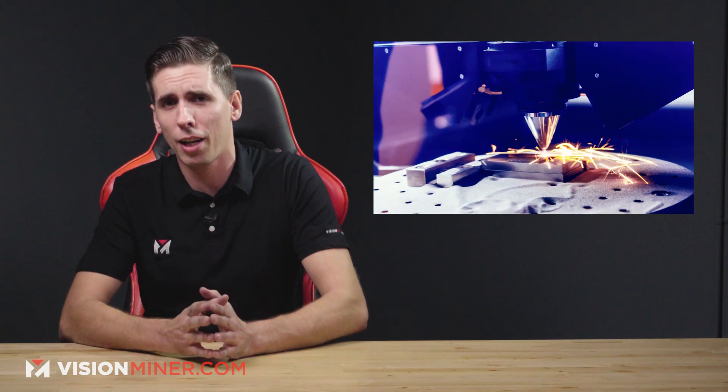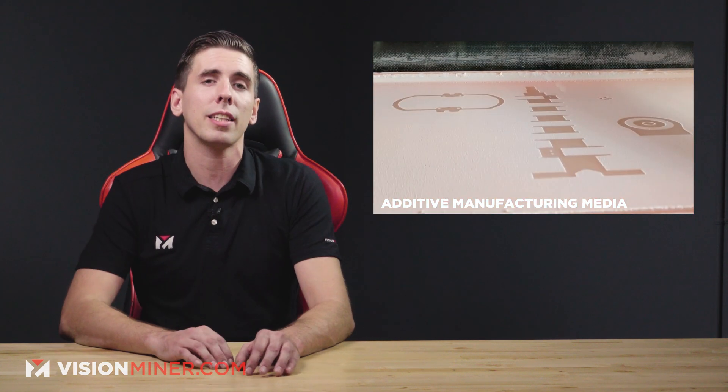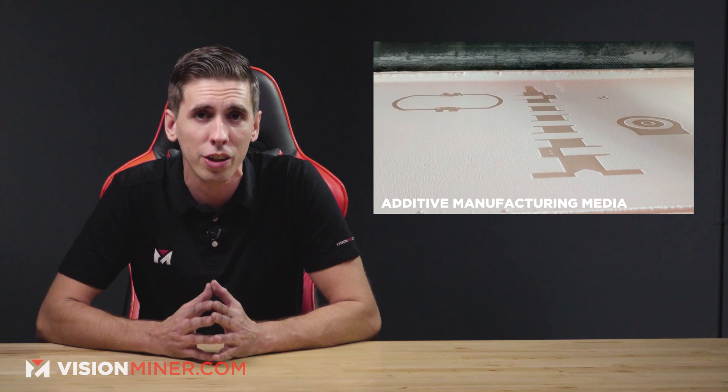Next, Furman Alloys released their Almighty 90. The Almighty family is a series of high-performance aluminum powders with excellent mechanical properties while being anodizable, polishable, and seawater resistant. Currently used in SLM and LMD printing processes, they claim it increases strength and gives 25% higher hardness than its predecessor. With tensile strength of more than 400 MPa and elongation at break of less than 25%, combined with a density of 99% — this is really cool to see.